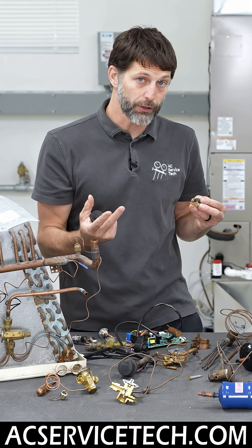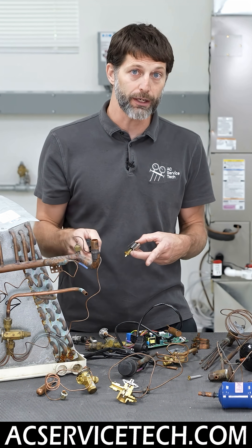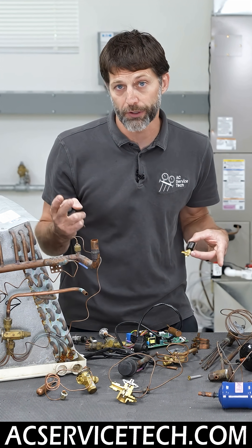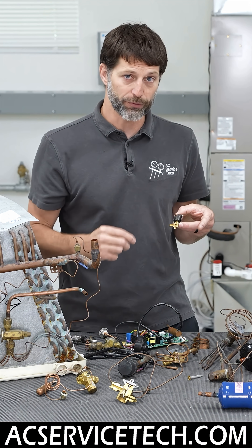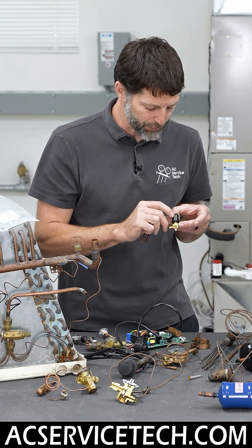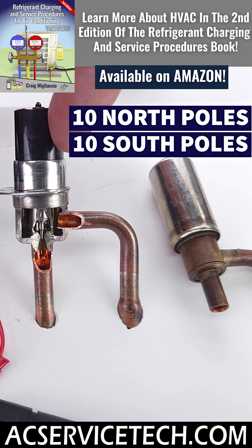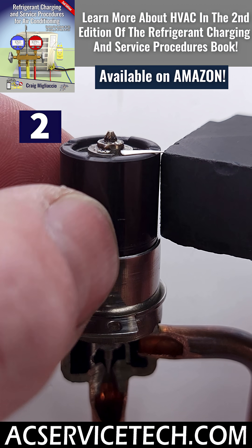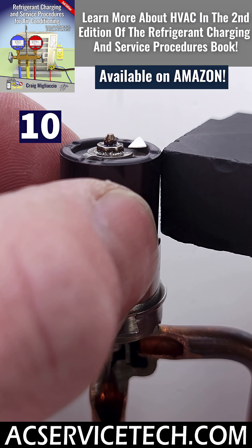What may occur is the system may fully shut or fully open the EEV upon the next startup. What it's doing is trying to locate the pin position by applying all the 12-volt pulses to spin this magnet, because this is an internal permanent magnet with many north and south poles on it. There's a whole other video on EEVs to fully see how they work.